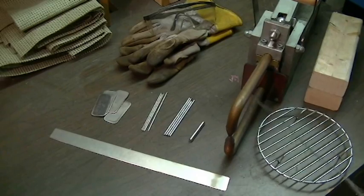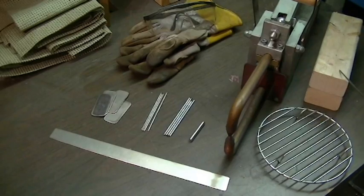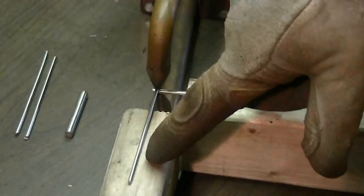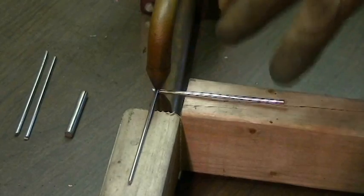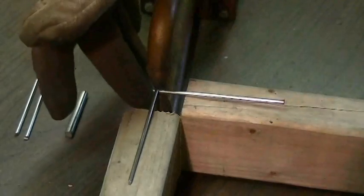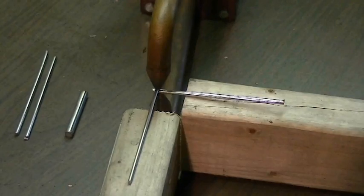The other things I'm going to be using today are a pair of gloves, a pair of safety glasses, and two pieces of 2x3 just ripped out of a piece of lumber — I'll show you what those are for in just a second. I have the 3/32 wire and the 1/8 inch wire set up on the blocks so I can have both hands free. This 2x3 is almost the perfect height to line up with the top of the bottom jaw — that's what those two blocks are for.